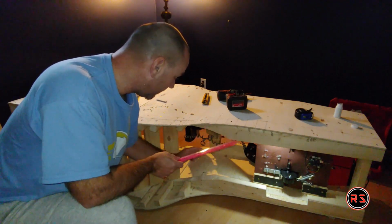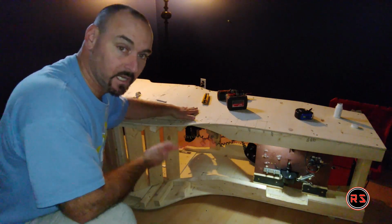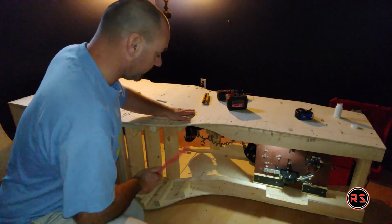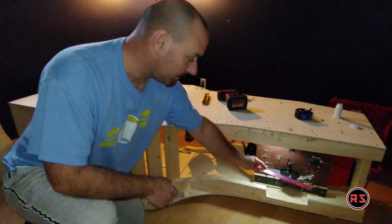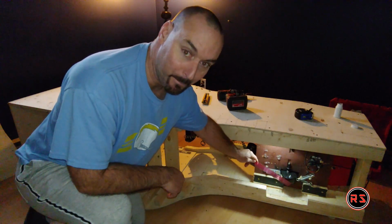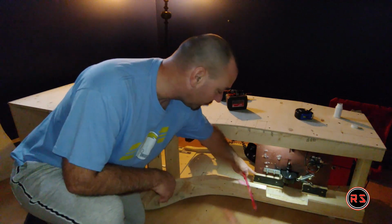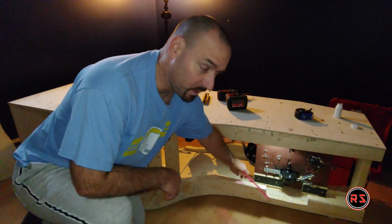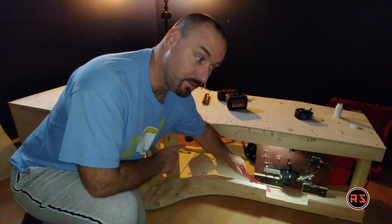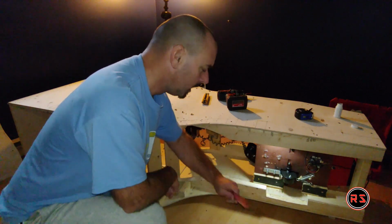Since the frame is the piece that holds the curve of the panel, I cannot remove that piece obviously. So I will cut it and I will install another piece flat here. The bottom of the pedal is sticking 2 inches from this piece, so I will cut a 2x4 for this section at 2 inches, so the pedal doesn't hit the floor.